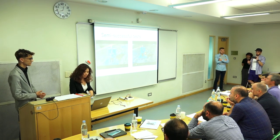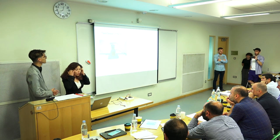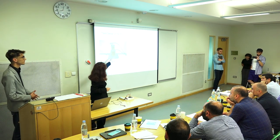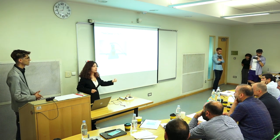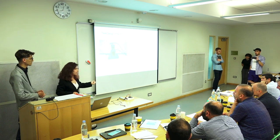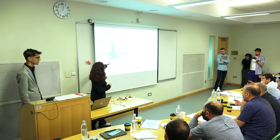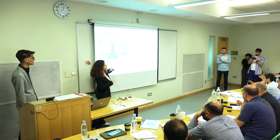So what we did was actually add an iron core to the inductive coil to make the magnetic force stronger. And because there's a magnet at the bottom of the pin, we were able to pull it much more easily. However, because there was a nail inside that the magnet was attracted to, it was a bit harder to detach the magnet from the top metallic pin.